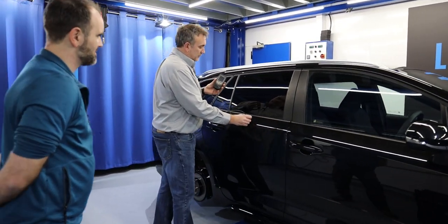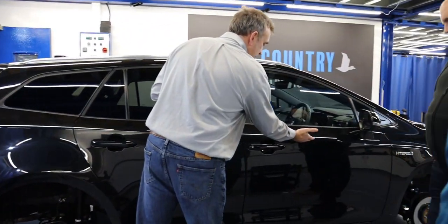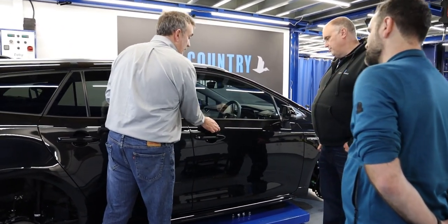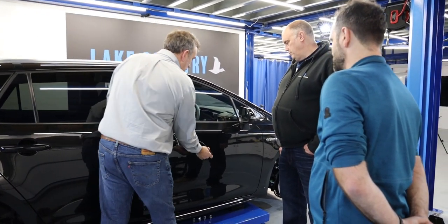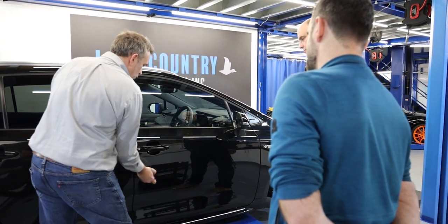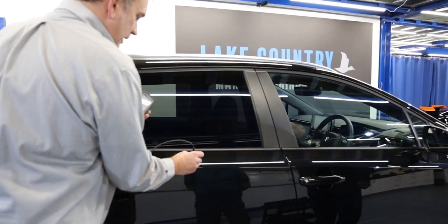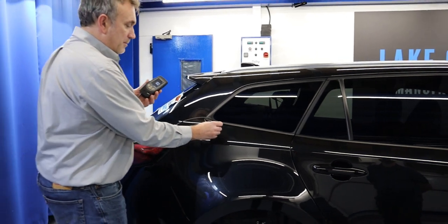You have to be careful when checking with any gauge. We once did an R8 where the top half was damaged, and we used an edge as a join line for the clear coat to keep it localized. Ideally, I'd take four or five readings per panel — one in the middle, one at the top, one on each part — just in case you get a random anomalous reading. So far it all looks fine.